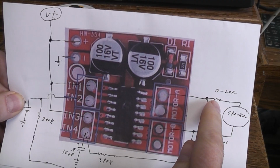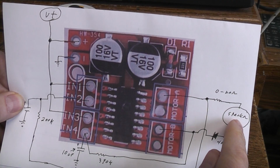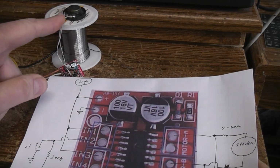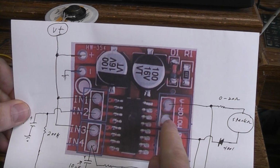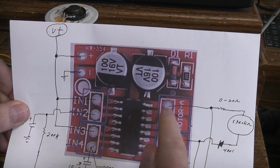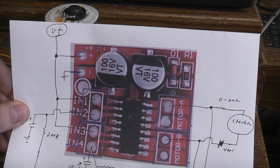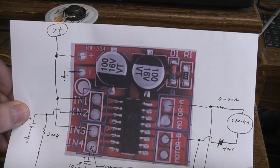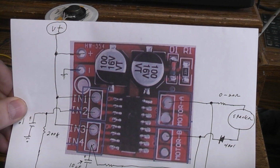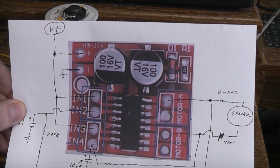This resistor up here before the speaker is simply to protect the speaker. This small little speaker that I'm using here is only rated at a 1/2 watt. And of course, being that this chip can deliver 1.5 amps of current, and in this case I'm running the circuit on 5 volts. Inside the robot I had a step-up regulator to give me enough voltage for the flashing eyes. So I've just tapped off that 5 volt supply to run my beeper as well.